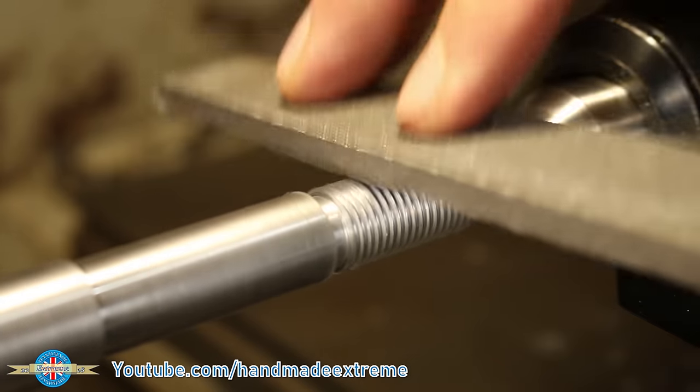If you're doing great big parts cutting great big threads with big tools, I'd use the more advanced method because it's going to reduce the tool load. But for small parts and home workshop stuff, this is a nice way of doing it — as you saw, I made that little mistake, and it's versatile: I could go in, do a little operation with a different tool, come back, pick up my thread where I left off, and carry on with no mistakes. We've ended up with a nice finished part — I'll get this parted off, there's a little hole to drill in the other end, and then I'll get it back to the person it's for.